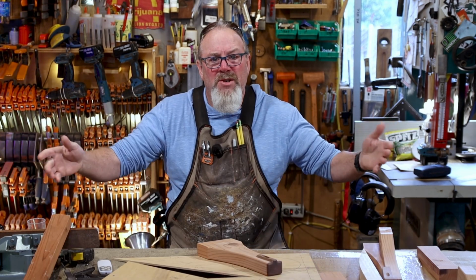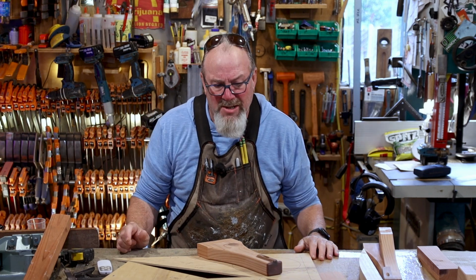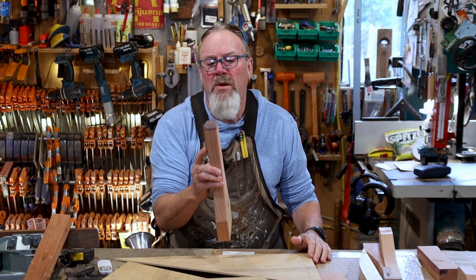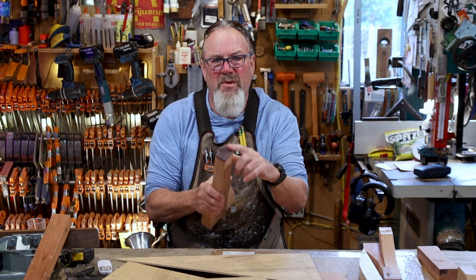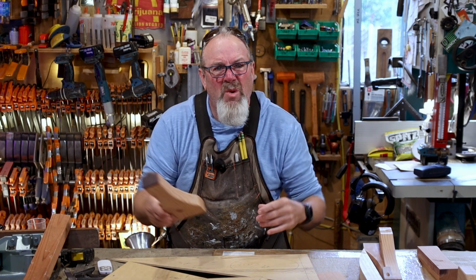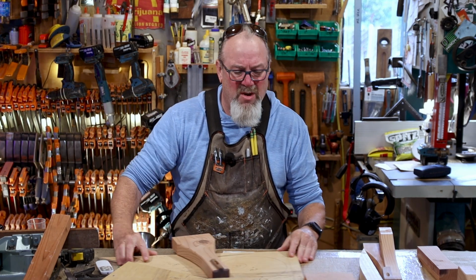If you're gonna build furniture that's gonna go outside, whether it's a table, a chair, whatever you put touching the ground, whether it's dirt or concrete or a Trex deck like we did, make sure you epoxy that bottom. And I'm telling you right now, don't waste your time with all the other crap. It doesn't work. I did enough experiments. I've done this before and it works really good. It lasts a long time. It's durable. But I just didn't want to do that to all of these things because there's 26 of them. And I had to do it anyway. So don't be like me, just go ahead and epoxy them.